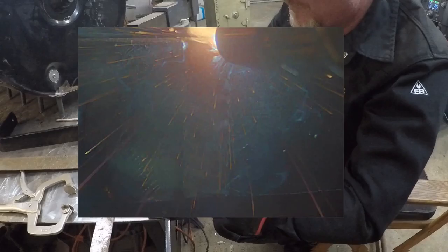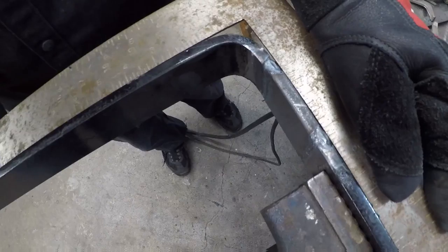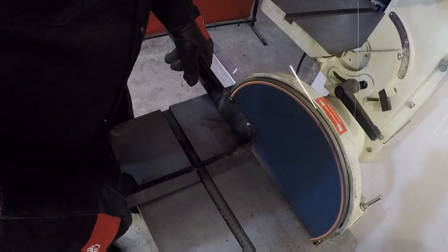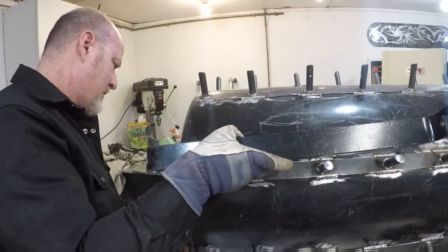These are big welds, and they're going to distort this metal. So tuning them up when you're done with a square is kind of a necessity. They're going to move around. Once I get them squared, I get my sander out, I start finishing. My handy jet disc sander is always a good way to make things flat. As long as you build that weld up enough, it's easy to finish.